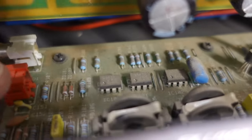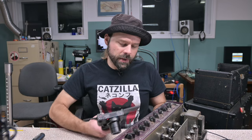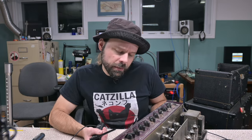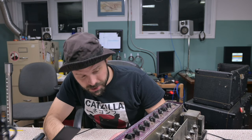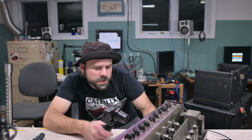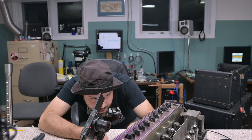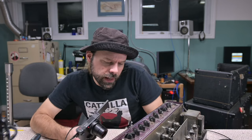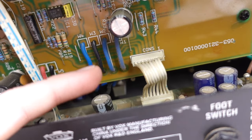We've got a couple chips there — those are going to be op amp buffers for the effects and the reverb. So this thing's got a solid-state effects loop and reverb, plus some transistors in there. That's got to be some sort of redesign — they didn't have transistors when they first designed this thing. Everything in here seems straightforward though. We'll go through and re-tack all those solder joints. Another IC, another transistor — Vox, what are you trying to pull here? Common HT fuse. I don't see a bridge rectifier; I'm guessing the power circuit is going to be underneath.